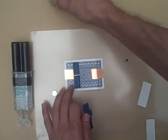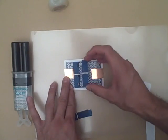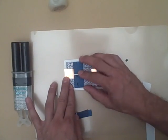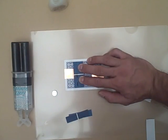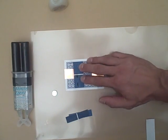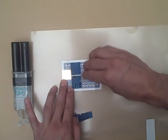I'm doing this on a low-density polyethylene — just like a plastic folder — because if I make a mistake and attach one of the solettes or the card to this working surface, it won't stick. I'm putting a few more drops of super glue — this is the thin stuff, cyanoacrylate — onto the top of that solette. That will attach the top of this one, which is negative, to the bottom of the neighboring solette, which is positive. Stringing them together in series.